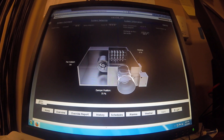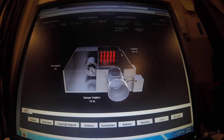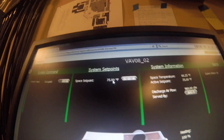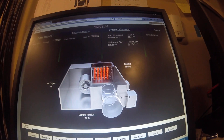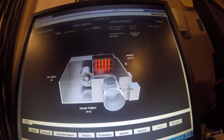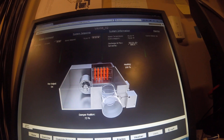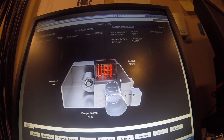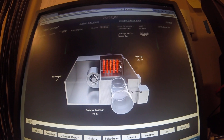I'm going back to VAV — I've got to troubleshoot all these VAVs. Watch number 2: number 2 is saying it's calling for heat. Space temperature setpoint is 75, but my space temperature is 66 degrees. They've been on since yesterday, in occupied mode — it should try to maintain setpoint, and it's not. I'm going to have to open up all these VAVs and see why. The contactor should be engaged and calling for it.